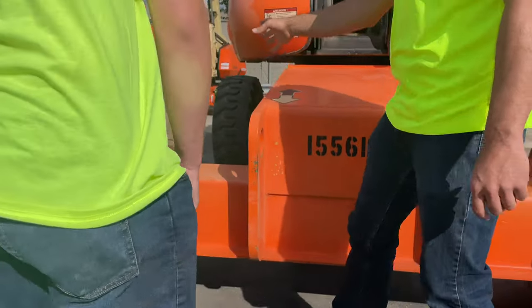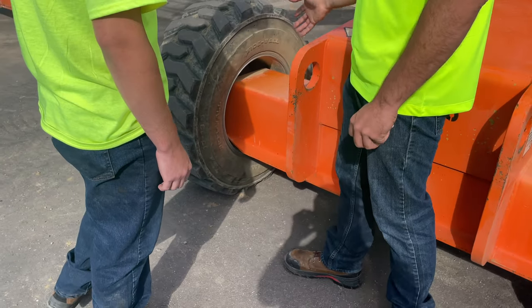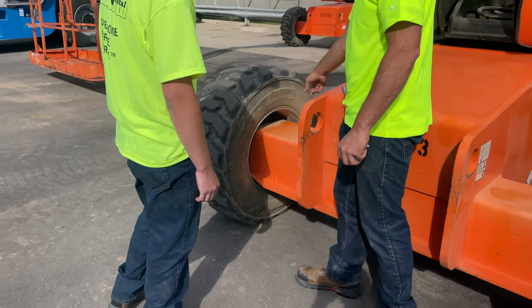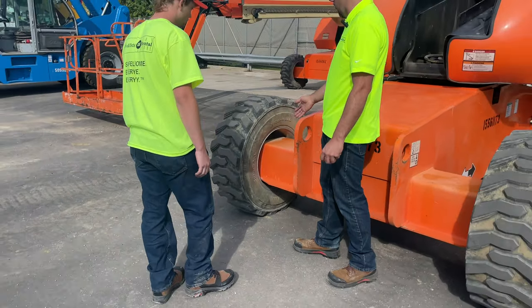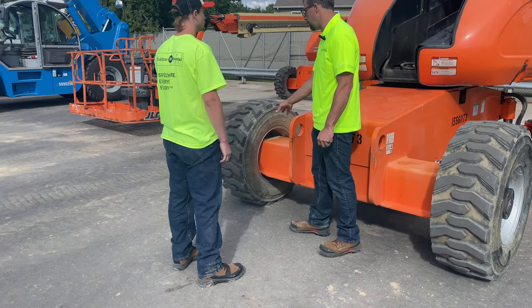When it comes to wheels, tires, and everything inside the rim, look at it — it's just dry dust and dirt in there. We're going to do the same thing to all four. That's a visual inspection. Is it oily? No, it's actually dry dirt, so I don't have any hub seal or brake leaks. That's going to be a pass.